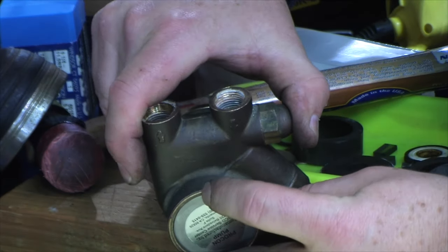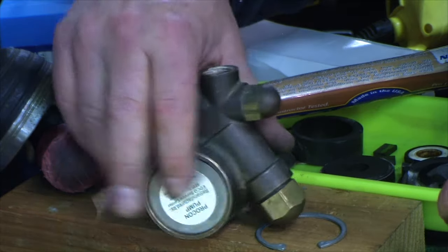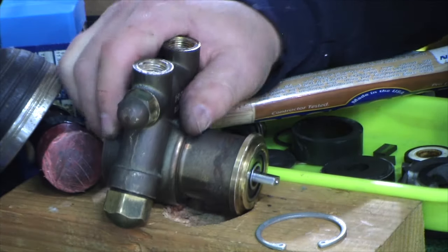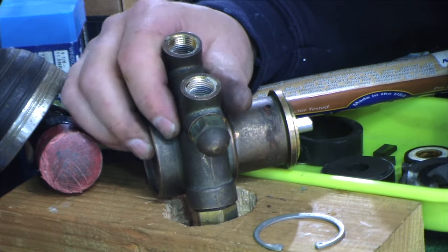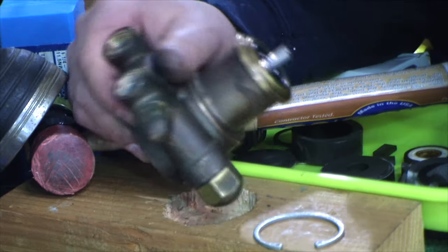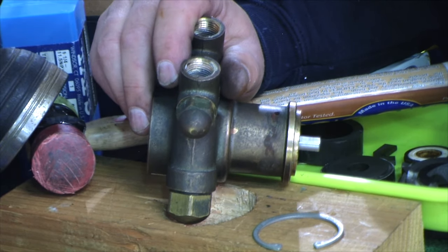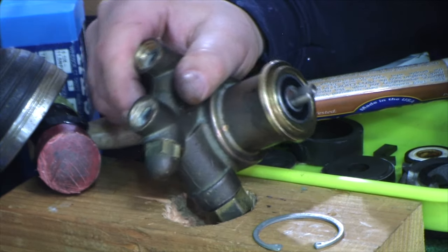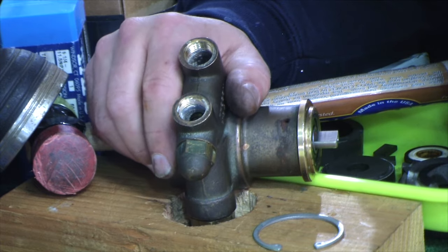Put a little mark on your pump as you start to rebuild it. If you're not doing this for food, some sticky or just a bit of grease could help keep those cross shafts together. But I don't know that you want grease in this pump if it's circulating through a carbonator or coffee machine — no reason to have petroleum products in your drinks.